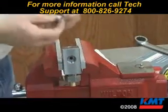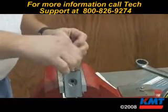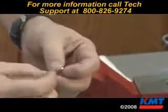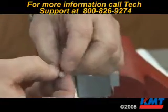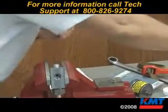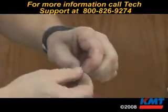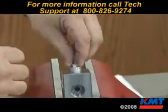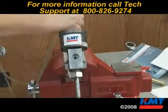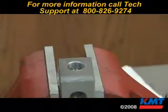The other tool we have is a seal installation tool. What we're going to do, we're going to place that down inside the body. If you notice, our seal has a little wedge ring on it and an O-ring. The wedge ring goes on the seal, facing up. We're going to put just a little bit of FML2 grease on the outside of the seal and position it in the tool with the wedge ring facing up. Use your little push tool to push it down, and it should bottom out on the top of that positioning tool.